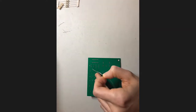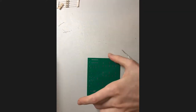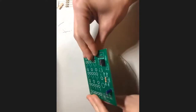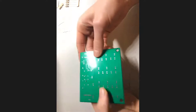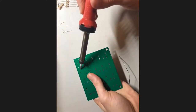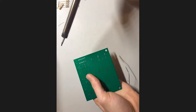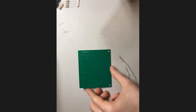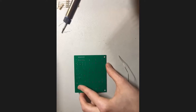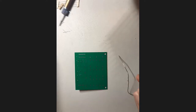Awesome. So once you've soldered your first leg onto one of these ICs, then it's stable. So you don't actually need to have the tape on anymore because one of the legs is stuck in. Hopefully that makes sense. And I'm maybe going to stick it in a little further right here. And remember, if there's too much solder accumulating on the end of your iron, then just go over to your wetted sponge or to your bucket of iron shavings or whatever that is, and stick it in there to remove the extra solder.